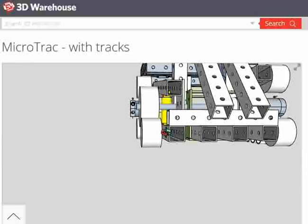Why don't we design the sprockets such that if you have to scale this to bulldozer scale, you can put on 2 or 3 of these cogs. Right now we can go with a minimum track size, probably 6 inches would be perfectly fine for this application. If you're talking about a 30,000 pound bulldozer, you want 18 inches or 2 feet, using multiple numbers of the same sprocket, which would make the track absolutely scalable from the smallest machine to the largest machine. What if the tracks were designed in 6 inch width base units, and then we can put several of them, 3 or 4, when you're talking about 18 or 24 inches.